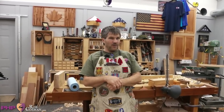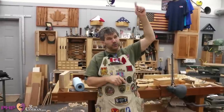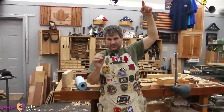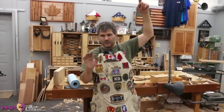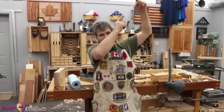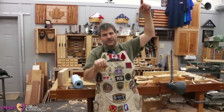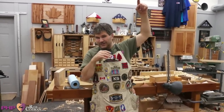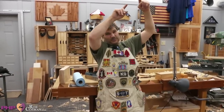So my philosophy is up here is the most pleasurable place to work. The sharper the blade is, the less effort is required. The sharper the blade, the better the finish. The sharper the blade, the more control you have. This is fun. As it drops down, this becomes work. You're pushing harder, you're having to advance the blade. It's digging, it's catching. If the wood's going to tear, it's going to tear when the blade is cutting edges down here, not so much up there.